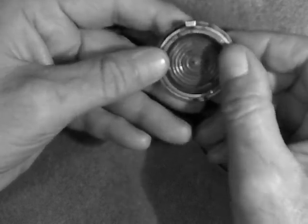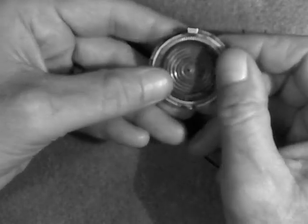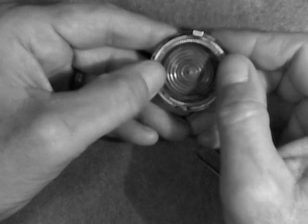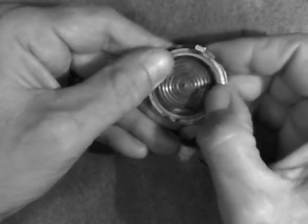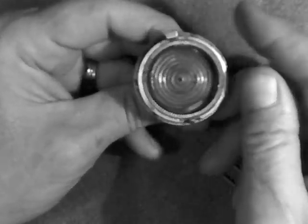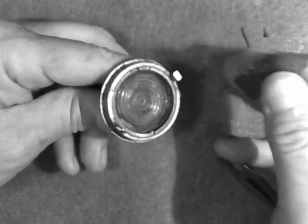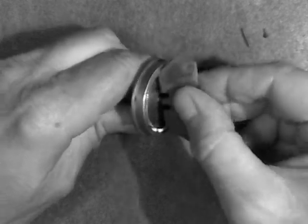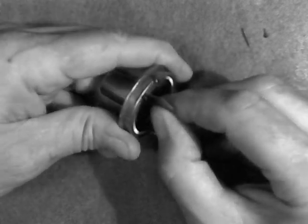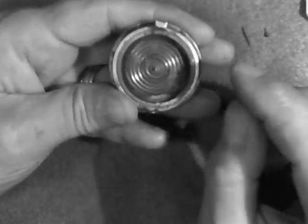If your reproducer is made of pot metal, it's very difficult in many of them to get this ring out — in some it's virtually impossible. Slowly get it started and slowly begin to screw it back down a little bit at a time, just using your thumb pressure. You'll finally reach a point where it gets really tight and doesn't want to turn anymore. There's a great trick — you've got these cutouts for a tool. An old razor knife blade just perfectly fits across that, so you can lay it in there and use it as a wrench. Just make sure you take the edge off so you don't cut yourself. Just snug that ring up — they don't have to be super tight, just enough to snug it so you don't get any vibration.